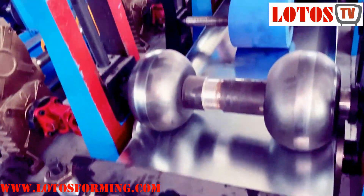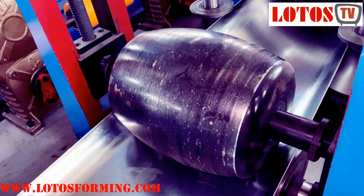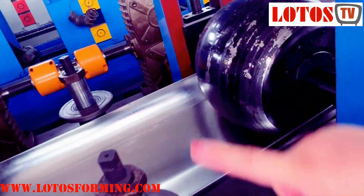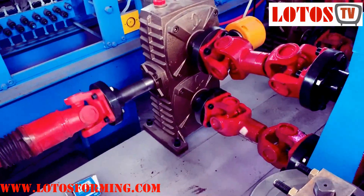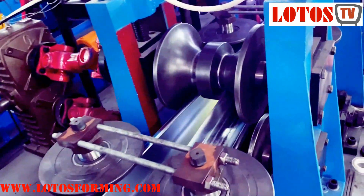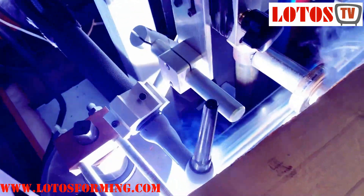Here is the input table. There are two-sided rollers step by step. The line combines 11 stations of forming rollers and another 11 steps for vertical and horizontal rollers. This is the forming roller and this is the assistant roller, also called the horizontal roller. It's driven by a double-layer gearbox — the upper and lower layers of rollers are all driven by the gearbox. The line speed is very low but the cost is very economical and the welding seam is perfect, so with this kind of solution it can reduce costs.